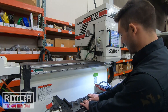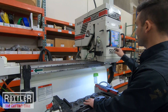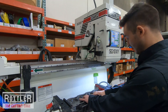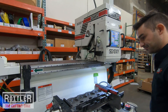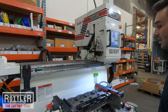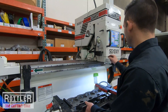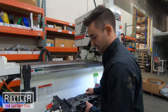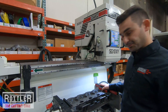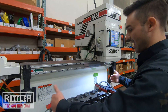Once the head is in and centered, clamp it up. Go into the software and tap the clamp button. You'll see the cylinder head is now clamped and flush on the top surface. I always like to give it a little wiggle to make sure it's in correctly and flat. Now we're going to create a new program with our template and align the fixture.